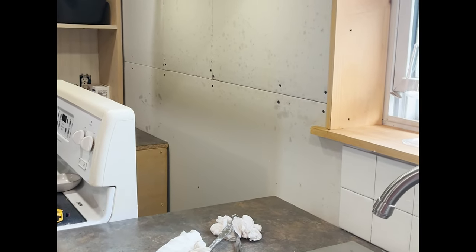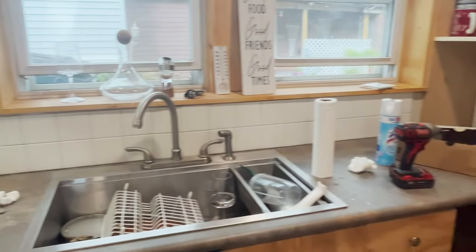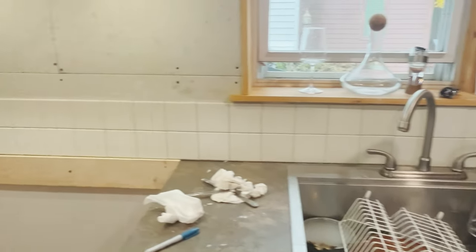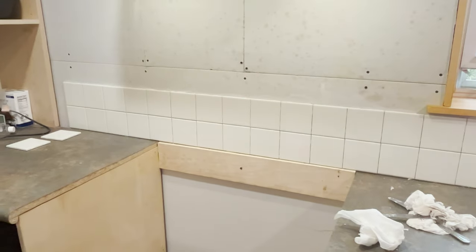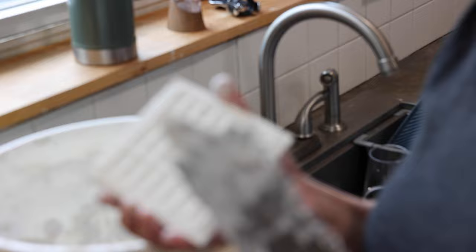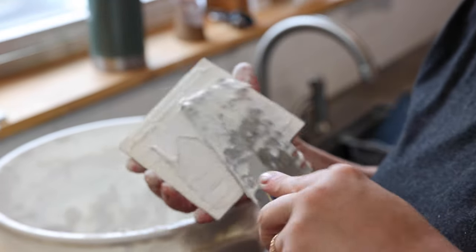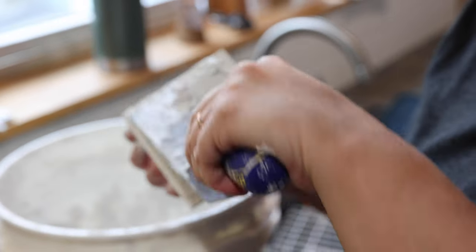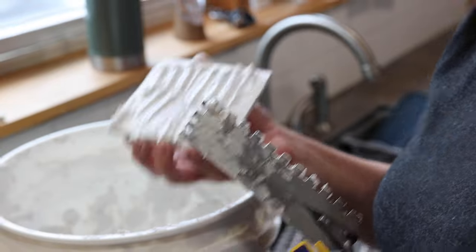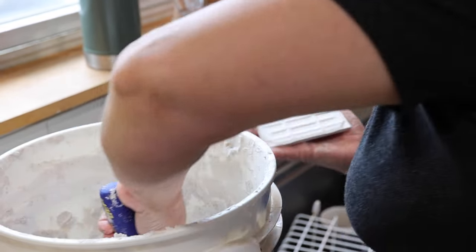It's not too hard. I actually used tile adhesive for the mortar, and as you can see I just used a square tile in a stacked pattern. I really like that simple pattern. Basically what I was doing, because of the way it worked best for me, was I would back butter the tile like you see here. It's good to get a good portion on there, and then you use the trowel to create these little divots on the tile.